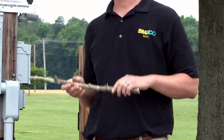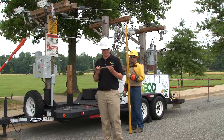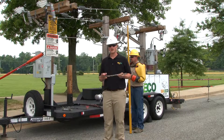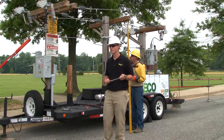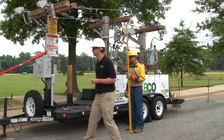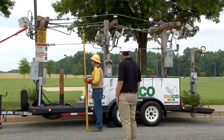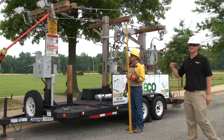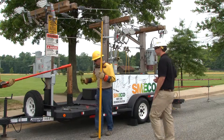You could take wood, put it in an electric circuit, and it would not complete that circuit. But unfortunately, this myth at 7200 volts could significantly harm or even kill you. That's why we're asking you not to use wood or any sort of object to try to touch our overhead lines or equipment. Now you see he bridges this — look at the light, light comes on. That 7200 volts is easily flowing through that wood. Wood is a conductor at 7200 volts.